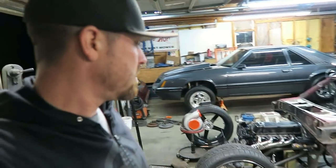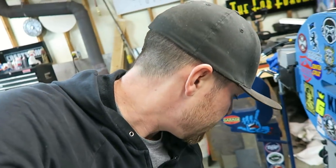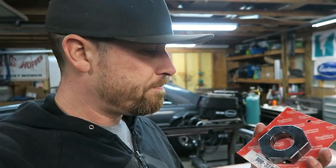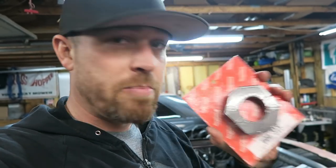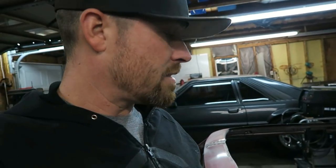The second thing is, I had mentioned, I don't know if it was in a video or on social, but the hydraulic cylinders back here, I was going to put a clamp on them, on the bottom, and that was just to basically make sure that hydraulic cylinder can't slide out. If you jack the car up or whatever and the rear end droops, you don't want that hydraulic cylinder to slide out, or, heaven forbid, you hit a big bump or something. So I was going to put these clamps on there. These are 1 5/8 billet aluminum. I was going to actually mount these on there.